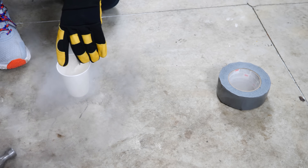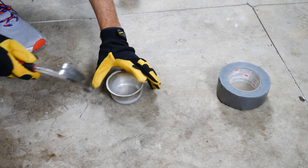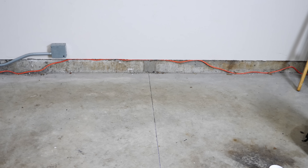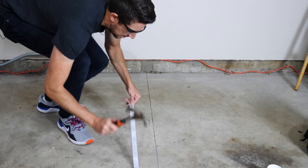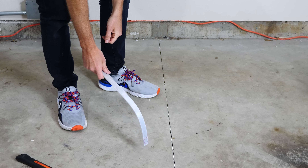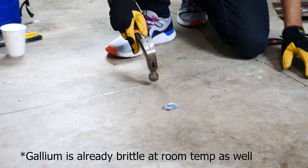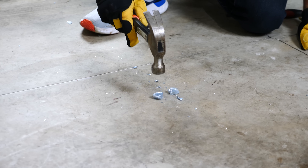That's why when I tried to break this aluminum bowl at liquid nitrogen temperatures it just bent — didn't break. Or even this aluminum beam: try hitting aluminum and it doesn't break. Here's frozen gallium cooled with liquid nitrogen — let's see how brittle it is. Whoa — that shattered. So can liquid nitrogen be used to make metals more brittle? Yes and no — it depends on the specific type of metal. If it's already ductile it probably won't work well, but if it's a very specific type of steel alloy you could break it.